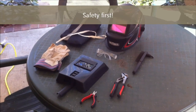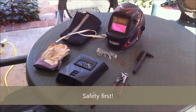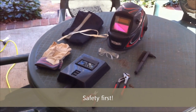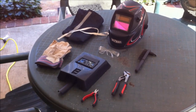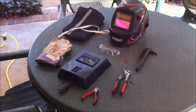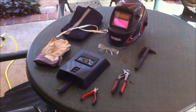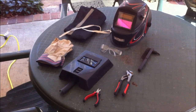Some of the basic tools you will need for hobby welding — we'll start with eye protection. You're going to need a welding mask, and in this case I've chosen an auto-darkening welding mask, which is not that expensive — it's between 30 and 50 bucks. Auto-darkening means that once you strike the arc, it will automatically trigger the visor to darken, to protect your eyes from UV radiation and from the brightness when you're welding.